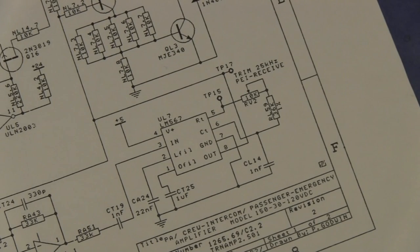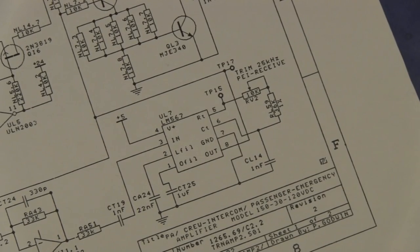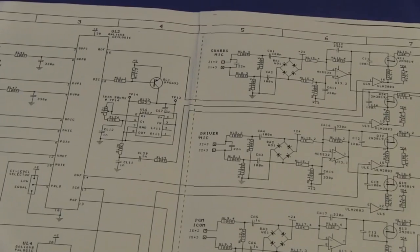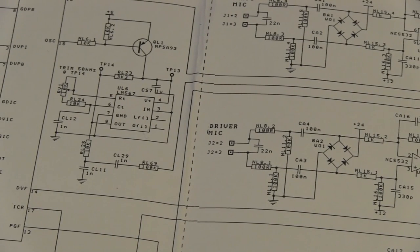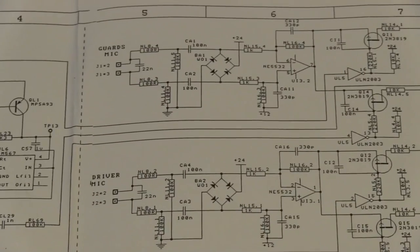Incidentally, getting these amplifiers back 18 and 20 years after manufacture, we discover, for example, that the 50 kilohertz oscillators have maybe drifted 200, 250, 300 hertz over that period of time. Is that a drama? No, because the tone decoder has a wider capture bandwidth than that. That's a creditably small range, and generally not due to chip drift but to capacitor and resistor drift. Okay, now, that's all the boring bit.